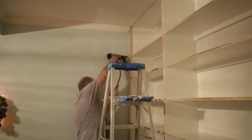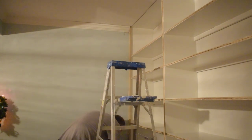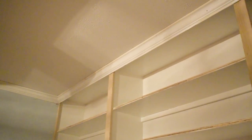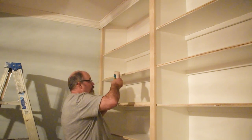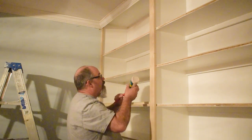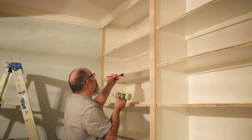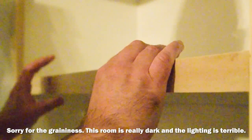Then I glued and nailed the facing hardwood — I used poplar since I'm painting it. I also took the crown molding that I'd pulled off the wall and put it across the top. I put glue across the front and added the front-facing hardwood, which does two things: it covers the plywood edge and makes the shelves look nice, and it also prevents the shelf from sagging, adding stability just like the piece in the back. For alignment, I get one edge lined up, tack it in, go to the other edge and line it up, making sure the top of the hardwood is level with the top of the shelf.